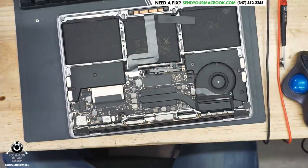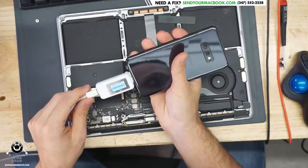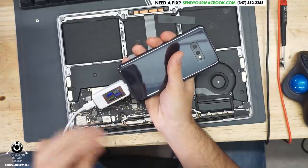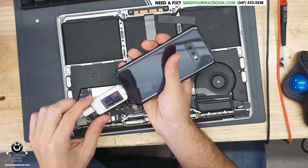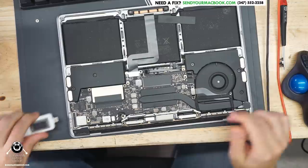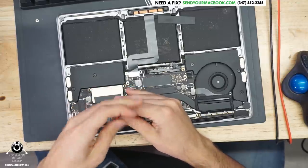I'm going to make sure my charger didn't blow up by plugging it into this Samsung S10e phone. When I plug it into my Samsung phone, it jumps up to 9 volts and 0.5 amps — it's trying to fast charge, only actually charging at 300 milliamps. But the point is: not only is this charger working, but it's able to differentiate whether to charge at 5 volts or 9 volts. So it's not an issue with my charger or my amp meter. We're going to take the board out of the case and see what it looks like on the other side.